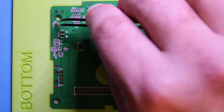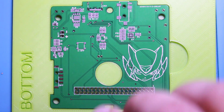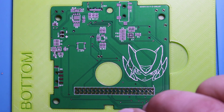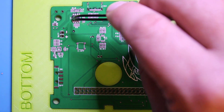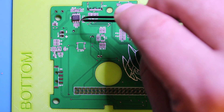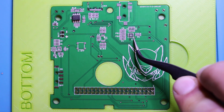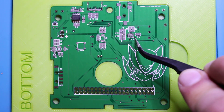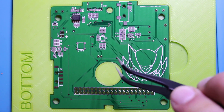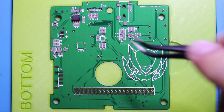I'm going to start laying out the parts. Very important: the orientation of these chips. There's a dot right here, for example, which indicates pin 1, and on this chip pin 1 has an indentation there as well. These smaller ones are kind of a pain — the silk screen was right there but you just have to find pin 1. The chip that goes on there has a very tiny dot on top, and on this one pin 1 is up in the corner.